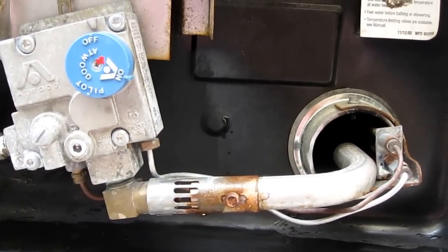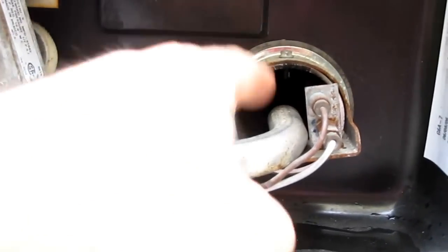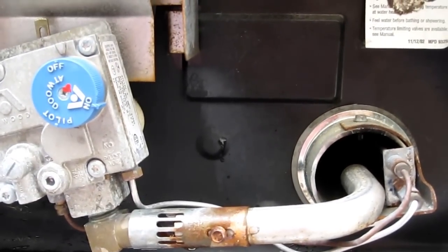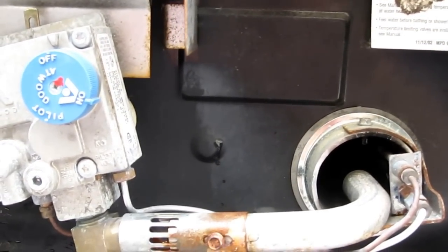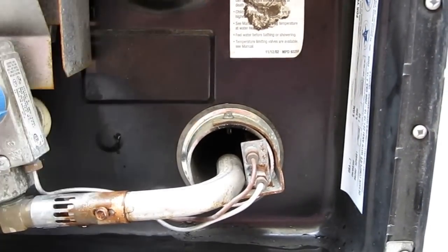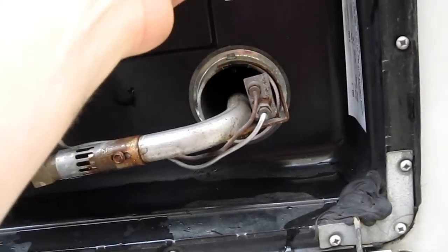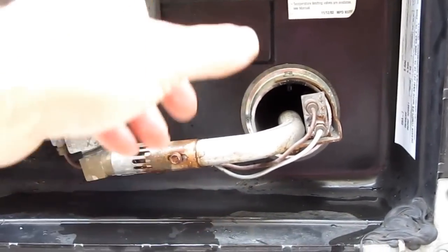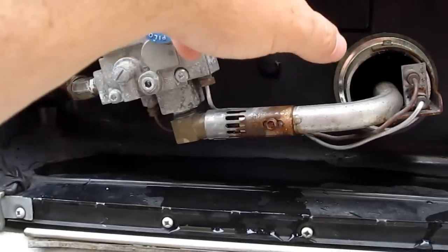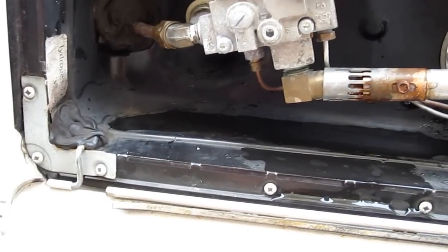After that, you come back and shut it down when it's actually hot, and you'll know because the flame will just shut off, and then you let it cool down. I let it cool down for probably 3-4 hours, and what I did is I used a small PVC stick, a long handle, probably 2 feet, and I just stick it in there and open the valve with the PVC, so this way I was not close, and then just release the pressure. You will see a lot of white coming out, because of the calcium and the vinegar and all that.